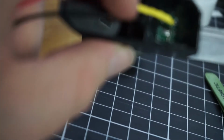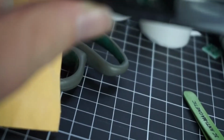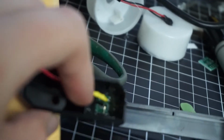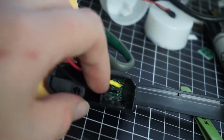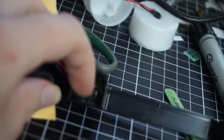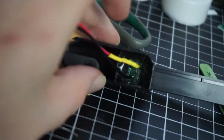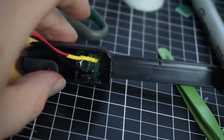Now the difference is going to be maybe 0.3 of a milliamp going through the LED. And it's a flickering LED anyway, so it's going to have a bit more drop than that. So, oh shit, that was way out of focus. Yeah, so should be no problem. I'm going to probably just bog this full of hot glue, just because the legs and everything on this thing are flapping in the breeze. So yeah, work on getting it plugged in.